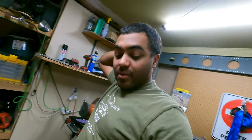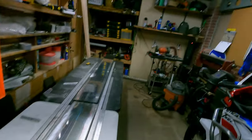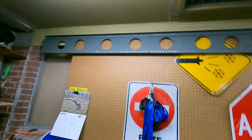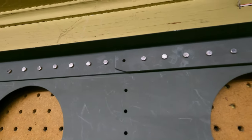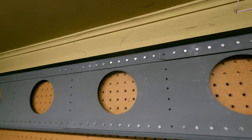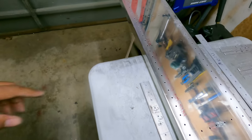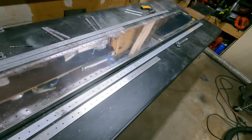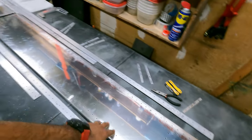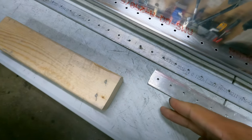Now that my back feels broken, oh man, I need to even think about what I need to do next. Guess next up, cut these angles before I paint. So last time I forgot to cut the angles where the pieces meet. So see that little 45, 30 degree angle cut in? I'm gonna do that as the next step. That way I can file it, get rid of all the sharp edges, and then these strips will be ready for primer. Then I'll start focusing on the rest of the pieces that I need to do on the main spar. So tomorrow, start making these cuts.